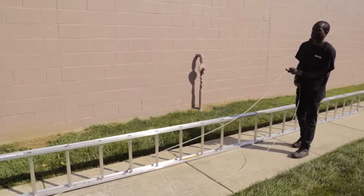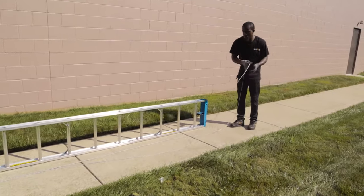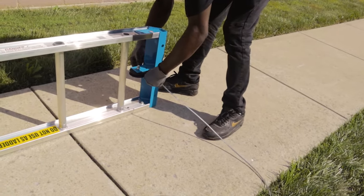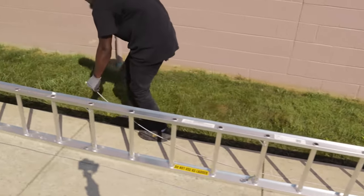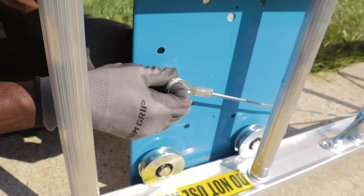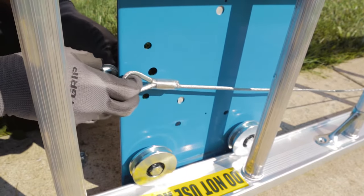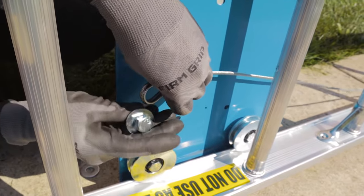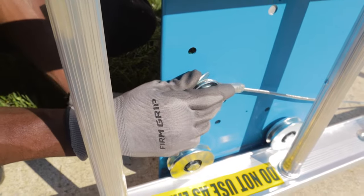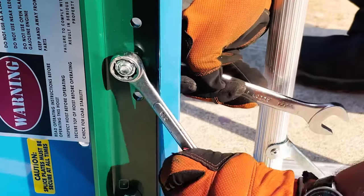Take the removed cable and walk it to the peak pulley. Thread the cable through the pulley and down the front of the track. Remove the half-inch bolt and nylon nut and sandwich the pulley cable between the bolt washer and the carriage washer. Tighten the nut back onto the bolt using 2 3/4-inch wrenches.